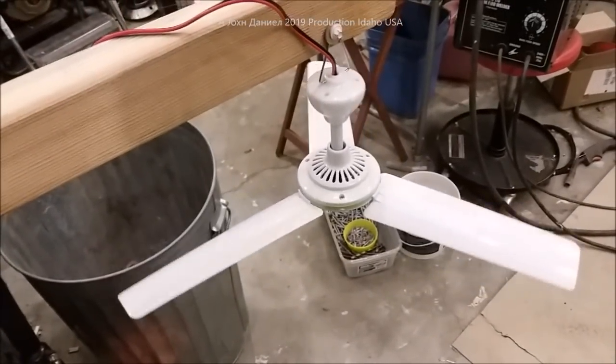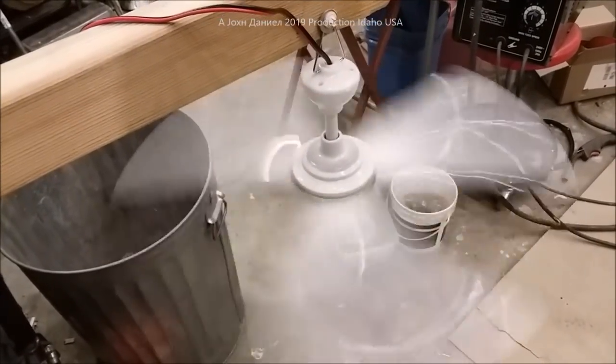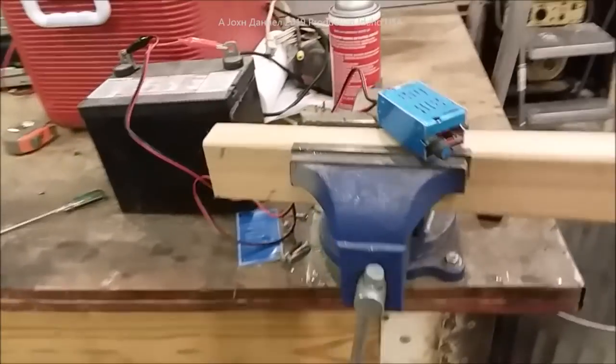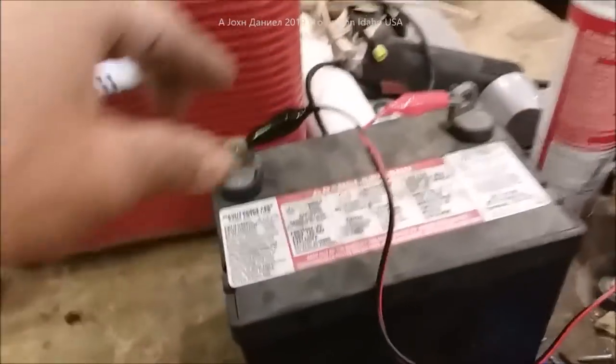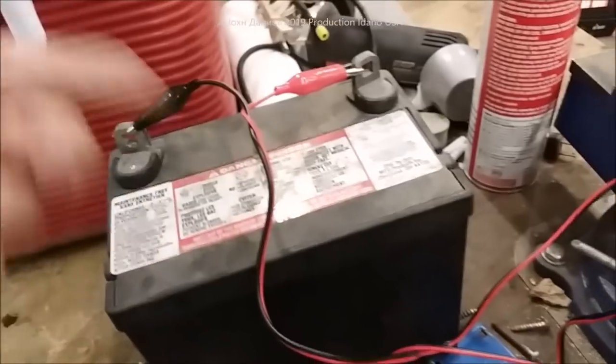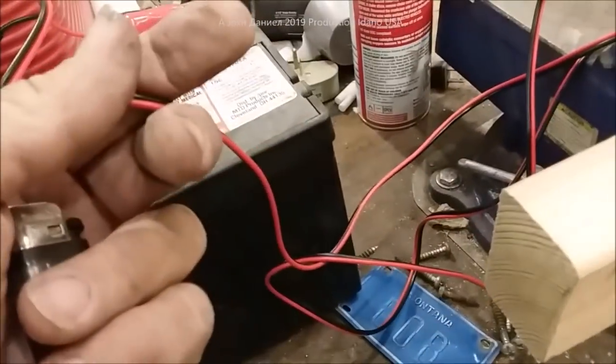Off and running. There it is. All right, guys — all the parts linked below. Hope that helps some people out. You can put any length of wire you want on there; if you go over 20 feet, go up to 18 gauge. Y'all be good.